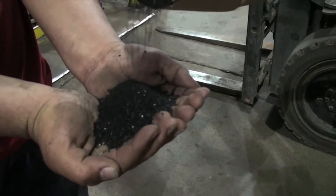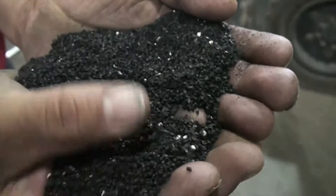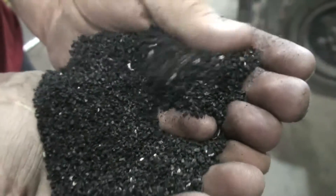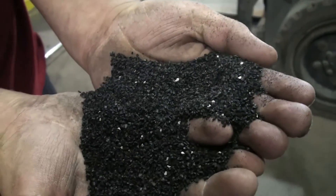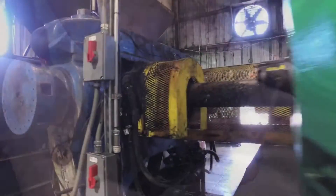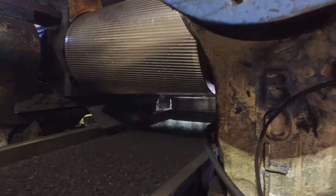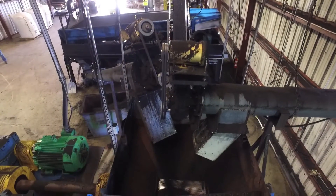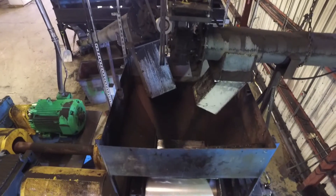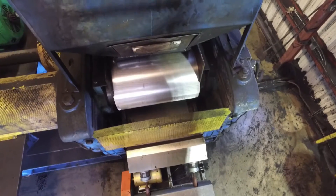The fourth stage of processing is to mill the crumb and to screen for the sizes needed to meet your market demand. As seen here, this 3/8th minus rubber granule can be milled down to minus 20 to 80 mesh fine rubber powders. Utilizing a CM dual drive cracker mill, the granulated rubber is cracked or milled between two serrated hardened rolls. The rolls are positioned very close together to achieve the cracking of the rubber. Heat is generated during this process, so a chiller is utilized to dissipate heat and keep the machine cool.